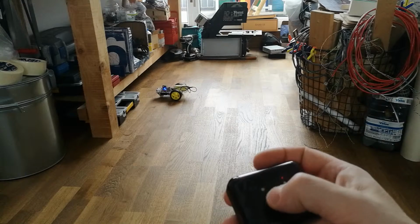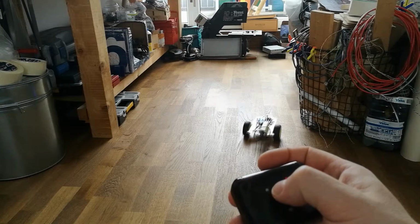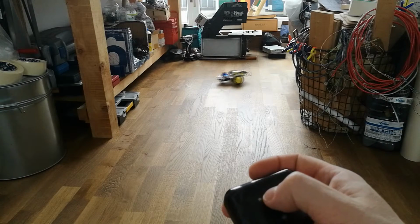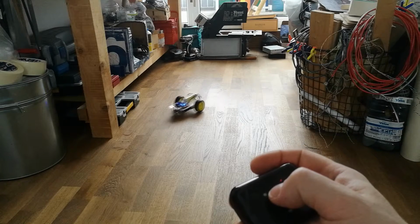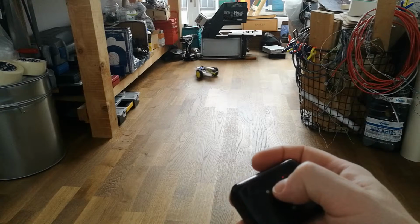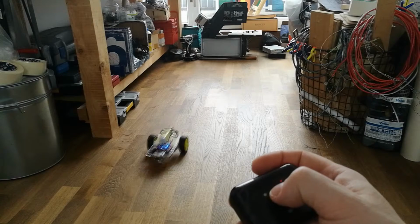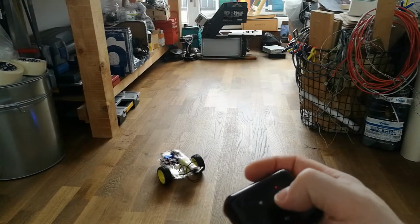I will not go over the technical details on sending commands part, as this is not the point of this video. Since this is a proof of concept, the car is only accepting commands such as forward, backward, left and right. It could be possible to implement sideways movements, such as going forward and turning slightly left, if PWM was used. Also, I have not been able to properly adapt the PS2 code to use the stream mode. Stream mode could allow you to use advanced gestures from Synaptics pointing sticks, such as tap and double tap, which could be used for special car functions, such as turning on the light or a buzzer.